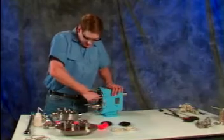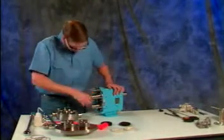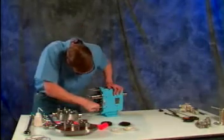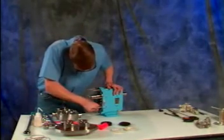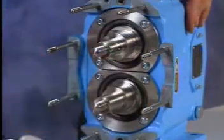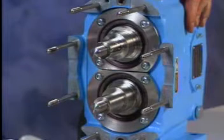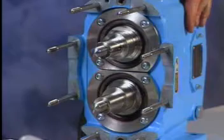Bearings fail from lack of lubricant, high overload, or water or product contamination. You may have to reconsider your lubrication schedule or look for a means to reduce the hydraulic loads. Excessively leaking seals can lead to the bearings being contaminated by product. Bearings also may fail from over-greasing if excessive grease is not removed at the cleanout holes.